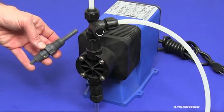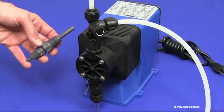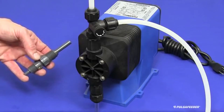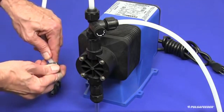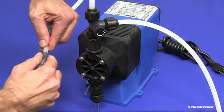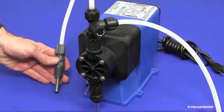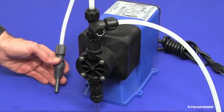The injector has a ½ inch NPT male thread intended to be inserted into a ½ inch NPT female thread for connection to the service. The thread on the injector should be wrapped with Teflon tape prior to insertion and tightened moderately tight with a small wrench. Cut the discharge tubing to the appropriate length and attach in a similar fashion. Slide the cap onto the tube, then press the tube onto the injector nipple and tighten the cap by hand as firmly as possible. If the pump is feeding directly into a sump without a pipe connection, the injector must still be used as it provides back pressure for the pump and is a barrier preventing the service fluid from mixing with the chemical in the discharge tubing.